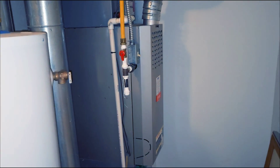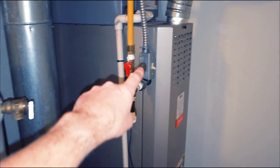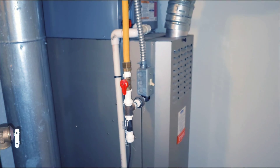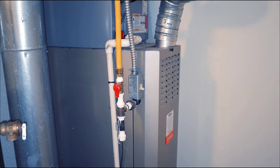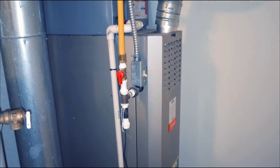Changing my filters did not help. So I figured out the fix and it's real simple. This is my furnace right here — it's a gas furnace. The first thing you're going to want to do is flip the switch right here. Almost all furnaces have a switch there. If you don't have one, go down to your breaker box and flip the breaker that goes to your furnace.